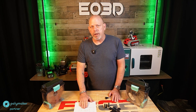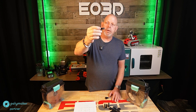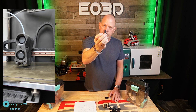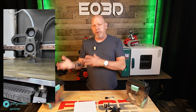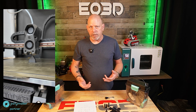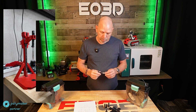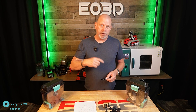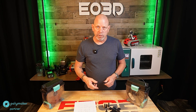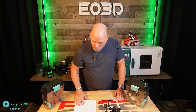I printed a full set of parts on the X-axis, which is laying down, and a full set on the Z-axis, which is standing up. Half of them I annealed, half are as-printed. On the annealed parts, I put the heat sets in first and then annealed the parts. Turtle Crawler brought that up — last time I annealed the parts and then put the heat sets in. He said to put the heat sets in first, then anneal. I did. It made a difference.